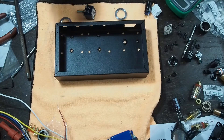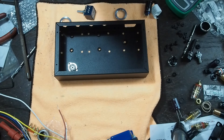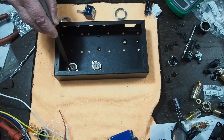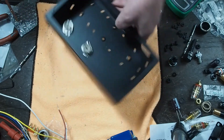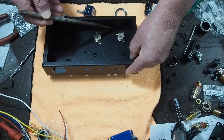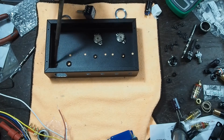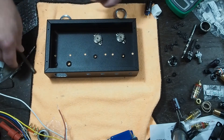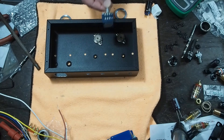So we're going to want to put the sockets in the amplifier angled like this, so that the windings will go over to this edge and then across down this corner to the heater filaments out of this transformer. By doing this, if we have the volume control right here in the middle, they're going to be going right next to this potentiometer — which is a bad idea.